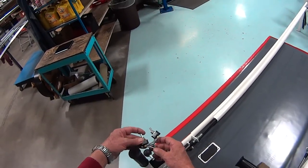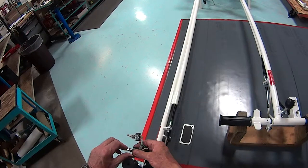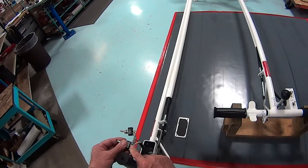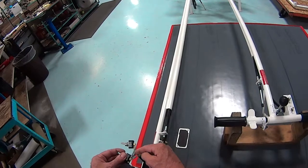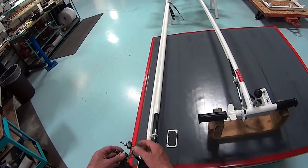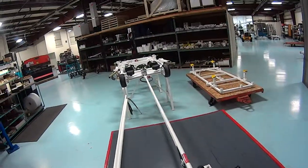Basically, when the unit is being run and you close this contact in either direction, the white wire has power in it from the battery. It makes contact that allows power to flow to the black wire, which goes to the relay on the pump and causes the motor to run. Same with the lights — when you turn the light switch on and off, it functions the same way.